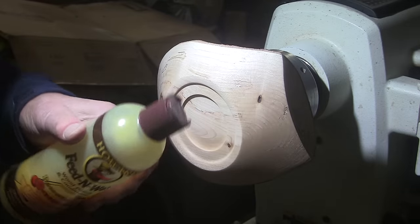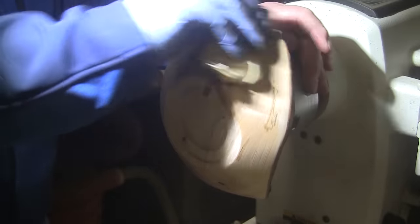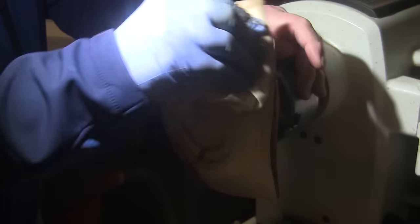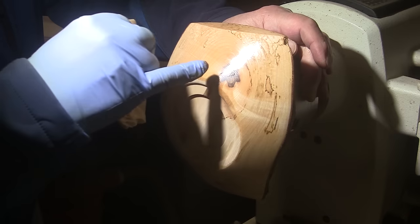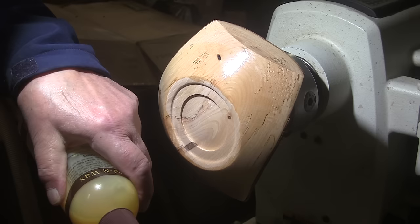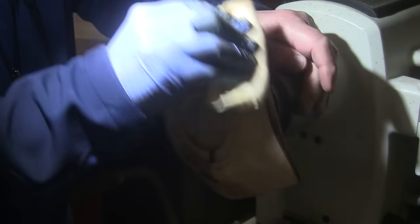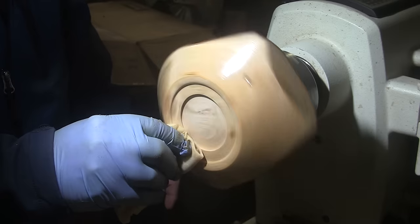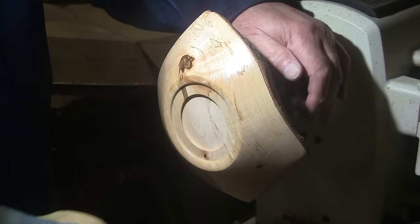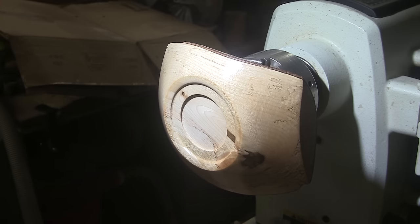I've decided on feed and wax for this piece because it's so smooth. This just gives it a nice smooth feel, preserves that smoothness, and I think it'll bring out the differences in the grain. There's that spalting and this nice little bark inclusion — I think that was the start of a branch. This stuff just makes the piece feel so good. I can't put it in the middle yet — if I want to sign it in here, I can't sign over this, so that'll come later. However, I can put this over the signature; I just can't put this on first. So there you go — that's kind of what it's going to look like. I'm going to let that set up for 20 minutes, buff it up real good, turn it around and we'll start working on the inside.